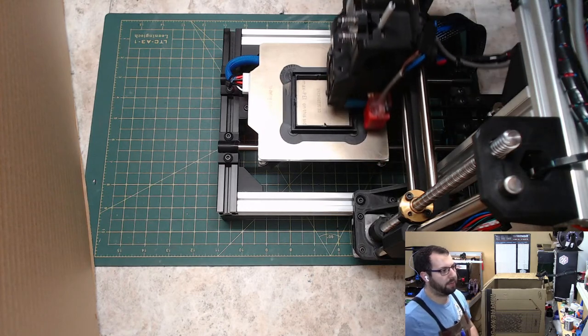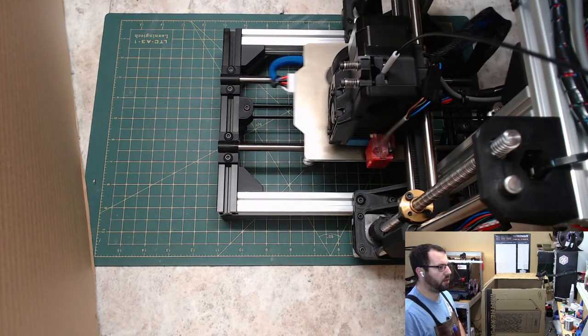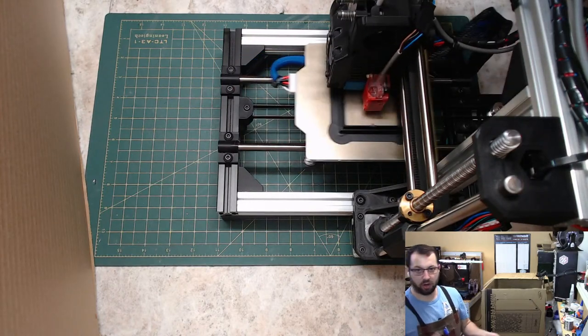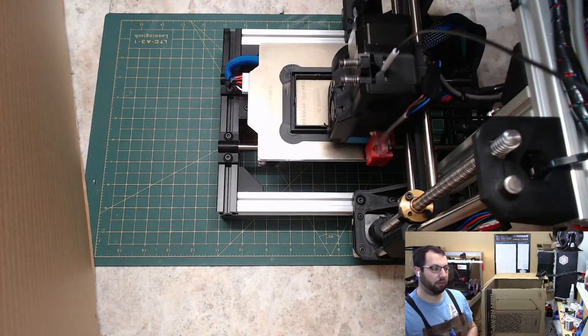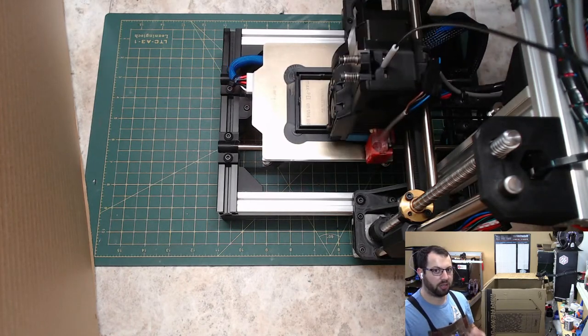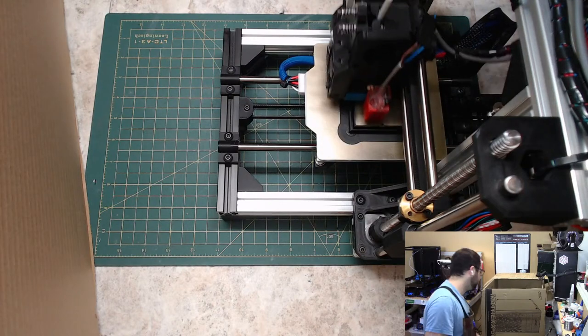Yeah, okay, so Raymond, polycarbonate doesn't like petroleum-based products. So think about it, if you have a PC part with a bearing in it, and the bearing starts to get warm and leak a little bit of grease or oil, and that gets into your part and starts deteriorating, and then you get a crack, and then it fails.